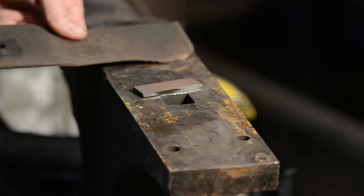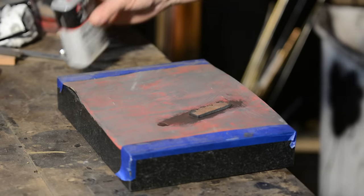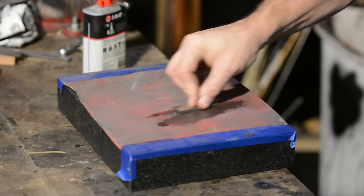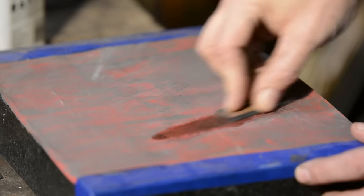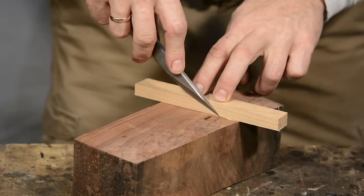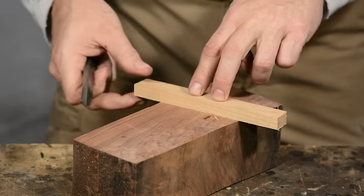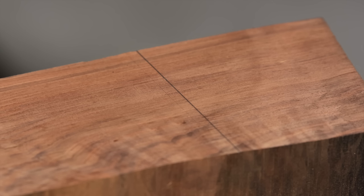I start by cutting off a small piece of the lawnmower blade — cut it laterally so the piece is only about two and a half inches long and three quarters of an inch wide. I'll clean the crud and rust off using heavy grit sandpaper, mounted on a machinist's block, but you could use any flat surface — masonite, glass, whatever. Marking knives can be made lefty, righty, or with a diamond profile that can cut ambidextrously. We'll make a right-hand knife, but you can easily make one with a diamond profile that cuts with either of two surfaces.